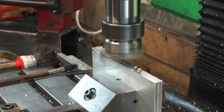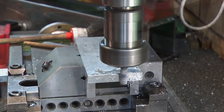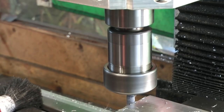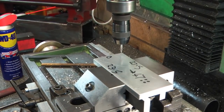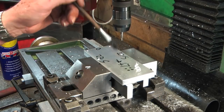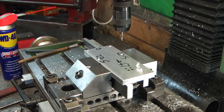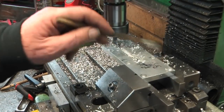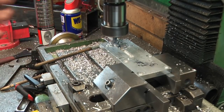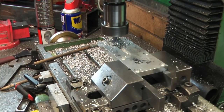It was only squared on the table with a square so it was close. I picked up the centre of everything - I want four holes on 47mm centres. We'll put four countersunk holes for M5 cap heads in here - 5mm drill through, countersink, deburr. It's sitting nicely in the vise. I've cut a slot through here - I've basically got to cut this corner piece off, so I'm putting a slot that way and then a slot this way to drop the bit off, then tidy it all up and finish it to size.